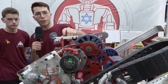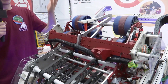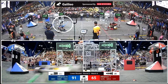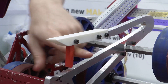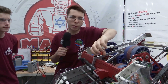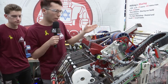Moving on to the climber — as you can see, the climber is also connected to the carriage. Because our elevator is the main part of this robot, when we want to climb the whole elevator goes up, the chain engages the chain stage, and then the whole elevator pulls down the carriage and the robot goes up. We also have a 3D printed part here that acts as a one-way door. It's 3D printed because if something doesn't go well during the climb, we want this part to take the impact and break rather than the whole hook, which is very easy to replace — similar to the intake, it's a mechanical fuse, and that helps the pit crew get the robot back quickly between matches.